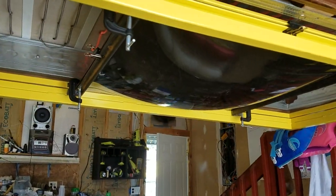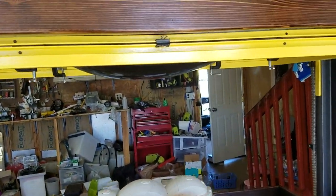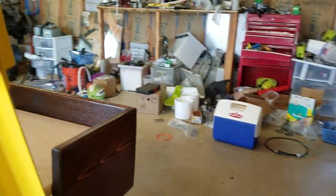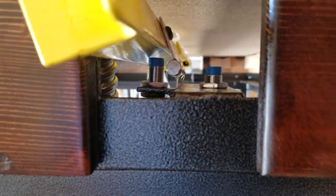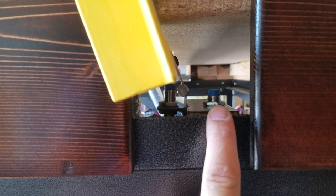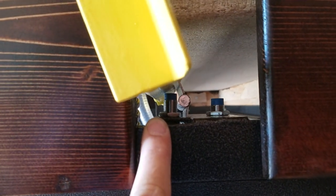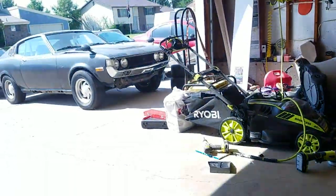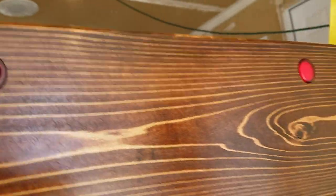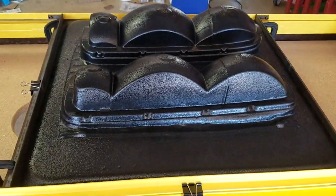We're sagging enough to give it a go. I'm hoping I can pull this handle down while I'm holding the phone — if I drop you, I'm sorry. We've got sensors right here — two sensors — so when I lower it, this sensor will automatically pick it up and automatically turn on the vacuum solenoid. This one here is for when it's up and will automatically turn off all the heater coils. All I have to do is just pull the handle down. We were having trouble there — one of my clamps was hitting — but that's why I have the emergency button over here.